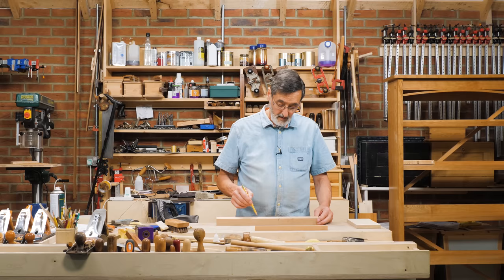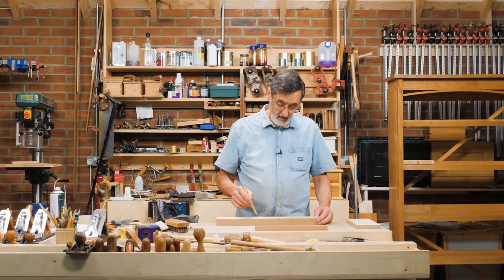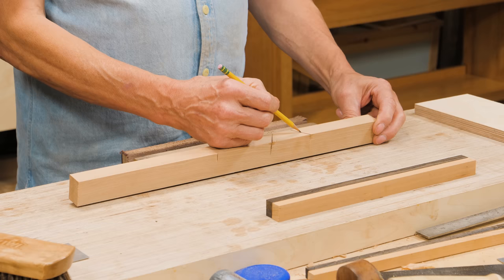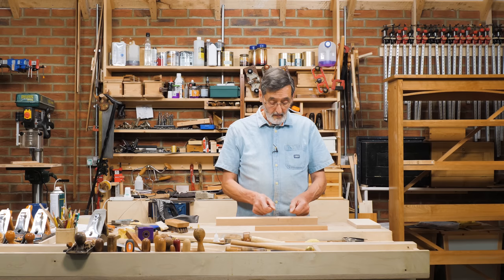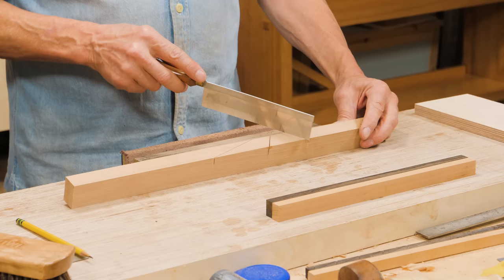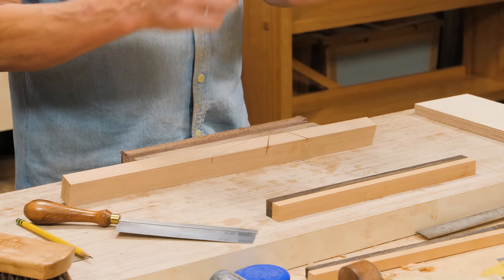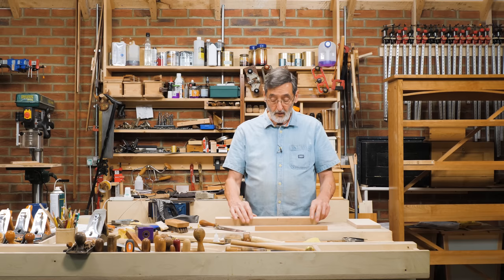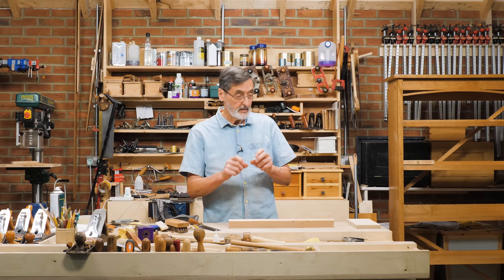If you can ignore this kerf here, I'm not using that. I didn't find it was any real advantage — I found it was a long cut that was difficult. But these two cuts here, this is a poor man's mitre box, but it's not 45 degrees. These are 54 degrees, two opposite 54 degrees. I just glued a piece of wood onto here with super glue, and then I cut these very accurately with a very thin saw. So when my saw goes into the kerf, it's almost sandwiched between the two sides. It's so fine. I don't go down very far because I don't need to.